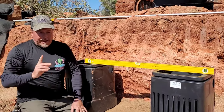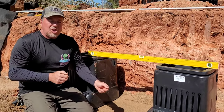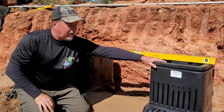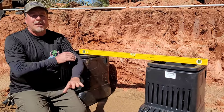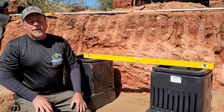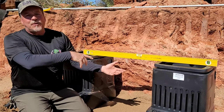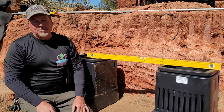Later on in this video, hang on with me. I'm going to show you a couple of really quick tips so that you know how to put this thing together yourself. One last thing I want to remind you of, I've already stated in the video, is that these are going to be powered by external pumps. So we put our plumbing in and our check valves inside this, and we put our lid on. There's literally no reason whatsoever to go back inside these ever again. And one last thing, the spacing that we have in between the vaults is so that we can set boulders in between, still gain access if we need to for whatever reason, but for the most part, these are going to be completely hidden away once we're done.